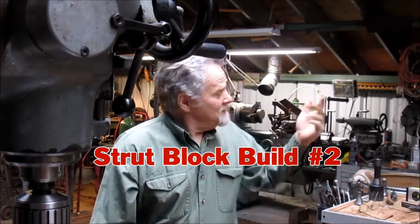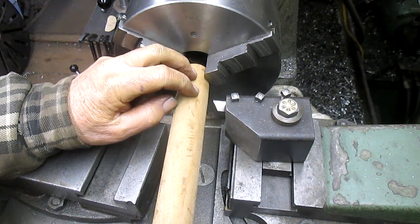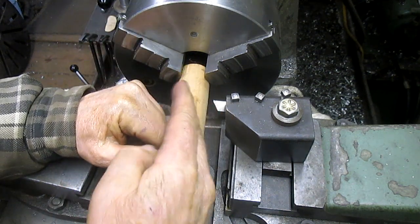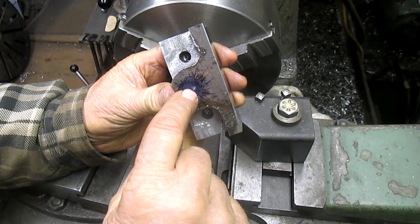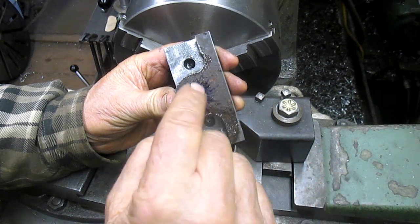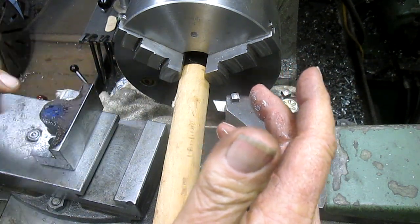Hi, Nick Collier here and this is my shop — come join me, we'll have some fun. While Jason's over there drilling holes in pieces, I'm trying to figure out how to get a three-quarter inch by one-foot taper in this piece, because we're going to cut a hole in the center of it. A half-inch pipe thread has a sixteenth per inch taper, which is three-quarters of an inch by a foot — the more accurate measurement.